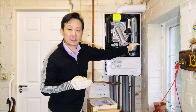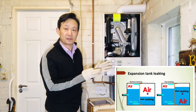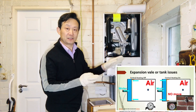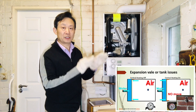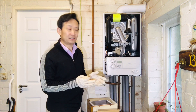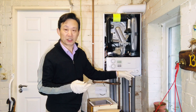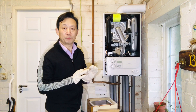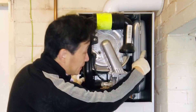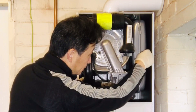But if this expansion tank has a leak, then the air will go into your central heating system. It can no longer be used for expansion. It pushes the water outside your system. Then later on, when your boiler and central heating cools down, the water volume reduces and the pressure will drop. This will happen again and again until the water pressure drops below zero and your boiler will not work. If we look at the expansion tank on the right hand side, you can see a small valve here. What you do is just remove the cap of this valve.